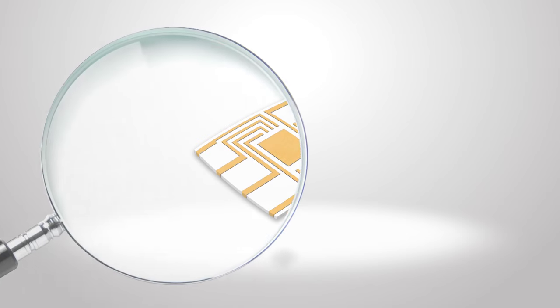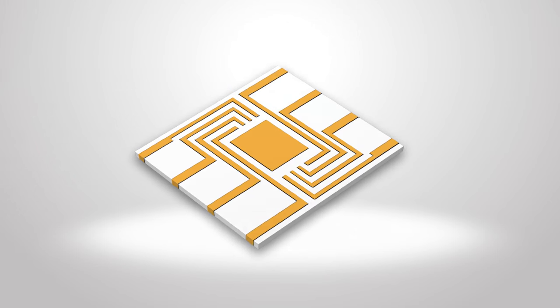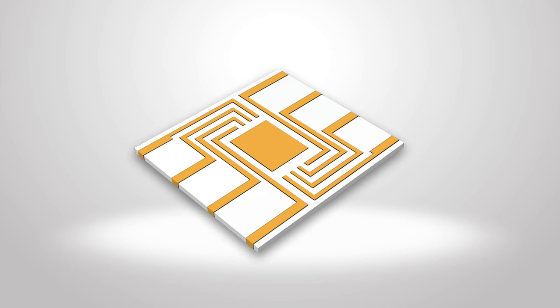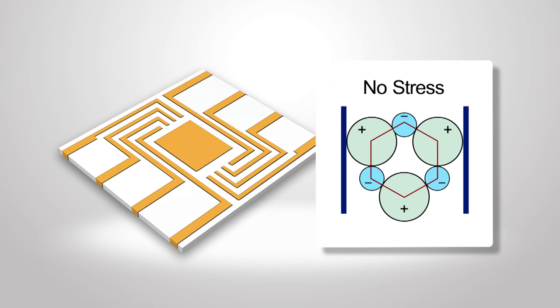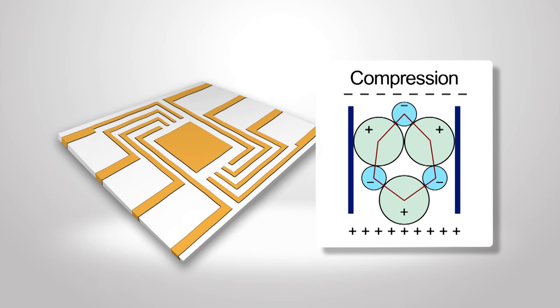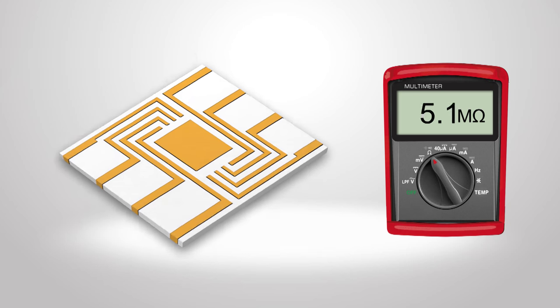The sensing material in a piezo-resistive strain gauge is a diaphragm formed on a piezo-silicon substrate, which flexes with applied positive or negative pressure. When flexing, the substrate material deforms, causing a change in the structure of the piezo-crystals. This change in structure results in a resistance change in the material.